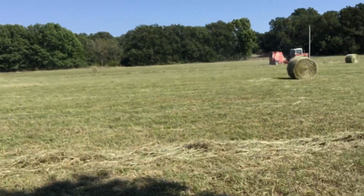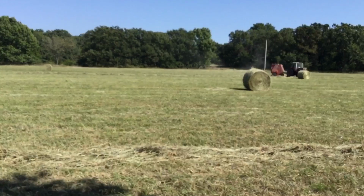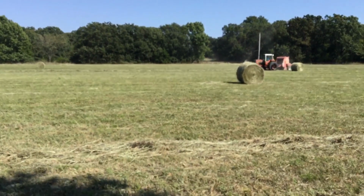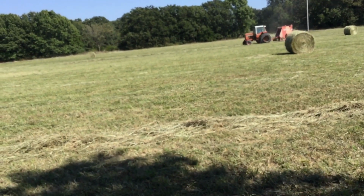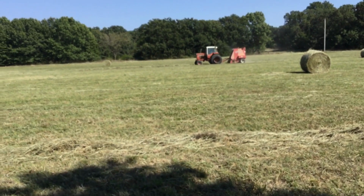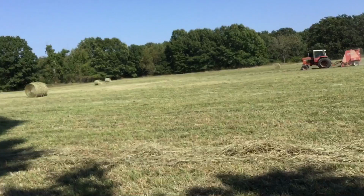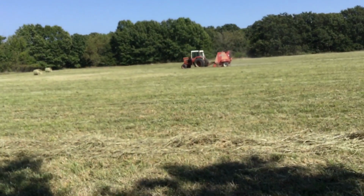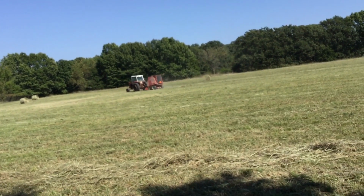Hope the wind isn't a problem. We're here. That's one of Scott's little hay jobs. He gets to bale, and we're giving this Gehl 1475 a try. We've done quite a little bit of figuring out to it and some little repair that we knew we needed to do, but it turns out that the little spring that causes the deal to set, to be able to cut the string off, is not working.